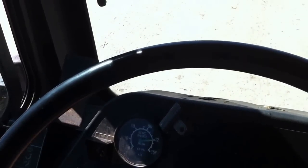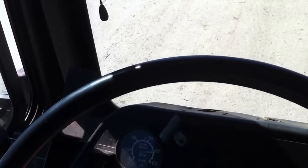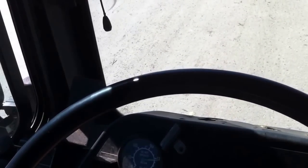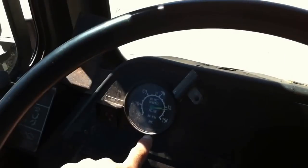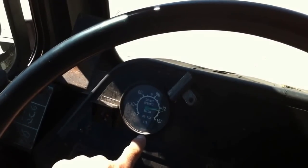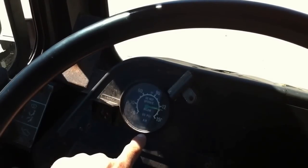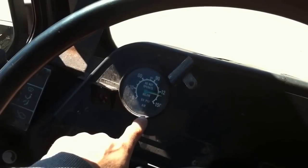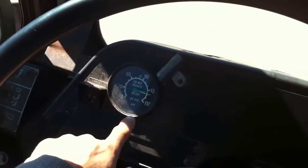So it's building right now. We reached about the 120 mark. And we will wait till the air dryer goes off to confirm the compressor stopped operation. If the compressor does not stop operating between 117 and 137, that will be a minor defect. And we're approaching the 125 mark. As the 2 needles are approaching that 125, they're slightly over the 120. We should be hearing the air dryer go off at any point in time now.